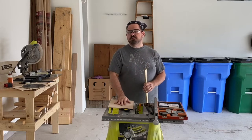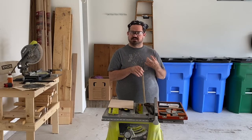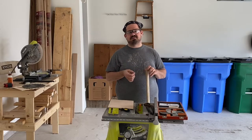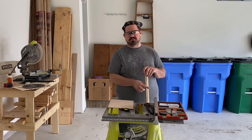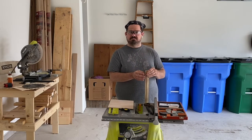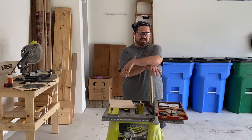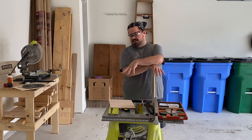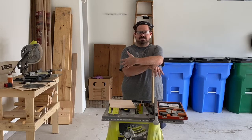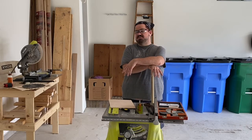Of course, there will be wood glue, and along the bottom there will also be copper tacks. I like the copper tacks because they're a little bit softer and they're pretty. That's really it. It's aesthetic. They tend to be a little finer, so I will actually have to drill some holes for them, just in this poplar board, not in the actual plyboard, just to give them a fighting chance to make it through without splitting that. So once I get all these cuts done and all the sides squared away to make sure everything fits right, because again, you don't want to have to watch that, then we will come back together and begin to finish them off.